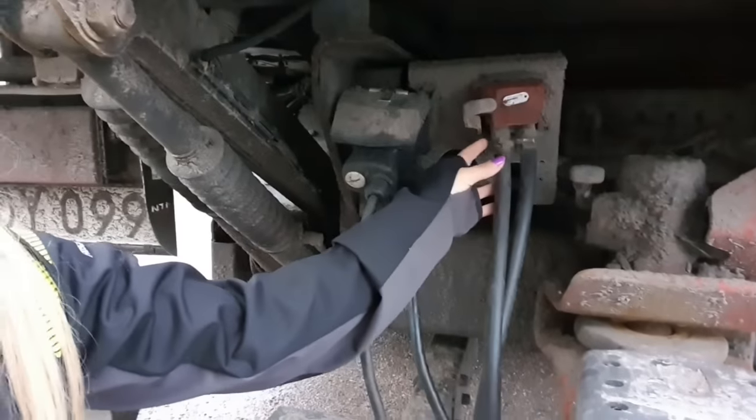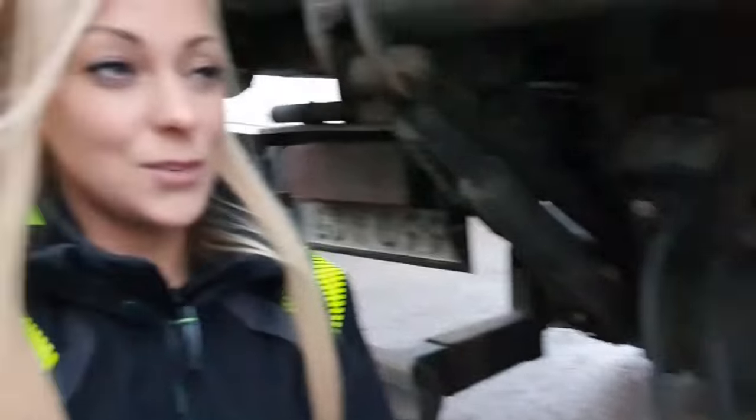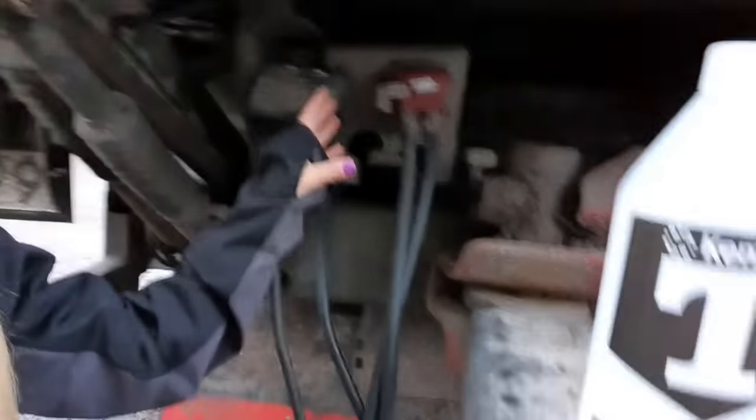Why we are using alcohol in our air system is because the duomatic runs on air - our brakes run on air. Sometimes water can get inside the hose that goes all the way back to the wheels, and as you know, when water gets cold it freezes. That can make the wheels freeze, also the brakes to freeze, which will make the wheels stop turning and can cause a lot of damage. You could get a flat tire or it could be a total disaster if the wagon just freezes while you're driving - you could go into a ditch. So it's really dangerous, which is why we're going to put alcohol inside the duomatic to dissolve any water that could be inside the hoses so we can be safe going up north into colder weather.